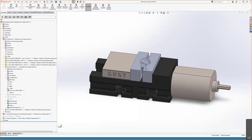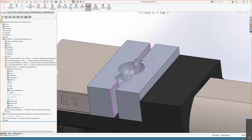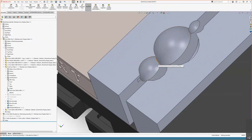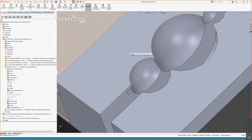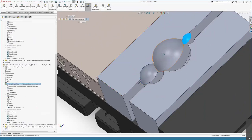Those are internal corners on the turbo encabulator, but they become external corners on the soft jaws. These are corners that we can make. We can't make the hard corners on the turbo encabulator, but we can make them on these. And what that means now is that we have some very sharp corner delivering a clamping load to a curved face. And that's not what we want from this setup. We want these spherical faces to clamp onto the spherical faces of the turbo encabulator. We want to have all of that force applied on the faces, not from some edge to a radius.